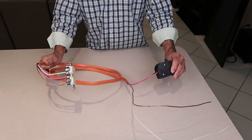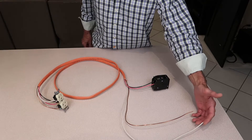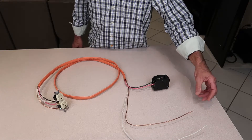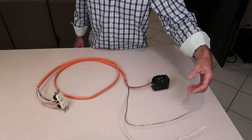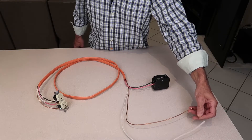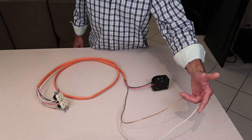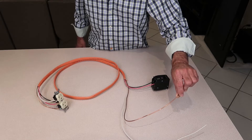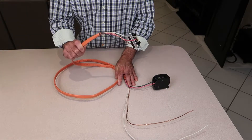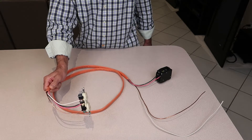I've already installed six of these dual voltage outlets and they've been up and running for almost two years now — right there in service. This is what it's going to look like wired up in your house: you have your two-pole circuit breaker, then your ground and neutral. In a main standalone panel, both ground and neutral go to the neutral bus which is grounded. In a sub panel, they're isolated — the neutral goes to the neutral bus and the grounds go to a separate ground bar isolated from the neutrals. Then you've got your outlet: 125 volts on top, 250 volts on the bottom.